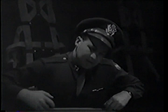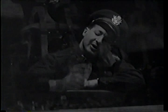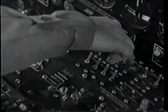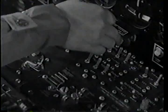Fire has to be fed by something, I figure. In an engine, that'd be gas and oil. They're the number one enemy, so I take care of them first. By shutting off the gas. Fuel shut off, valve closed, booster pump off. Then I feather it, so if an oil line's opened up, oil won't be squirting around in there feeding the fire.